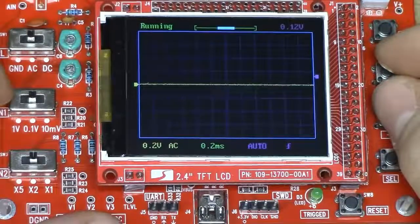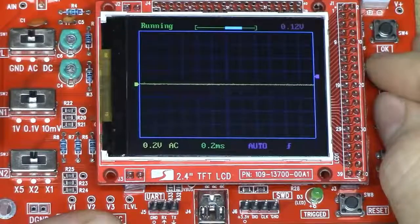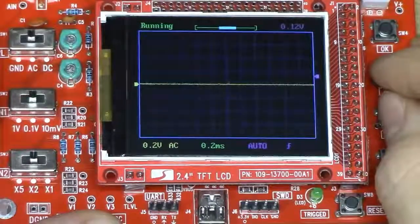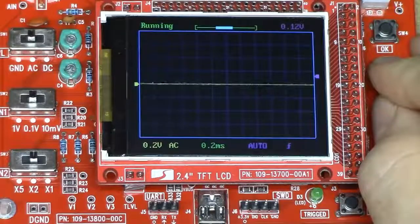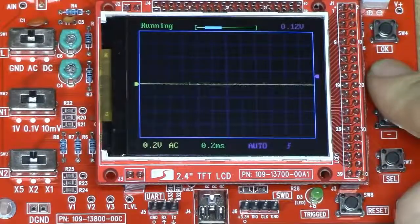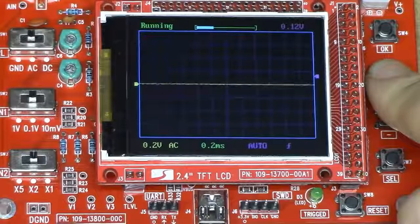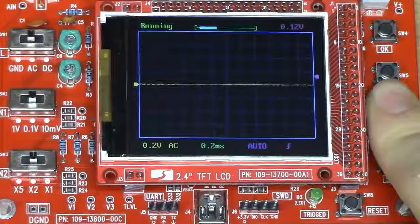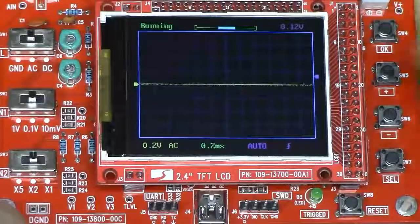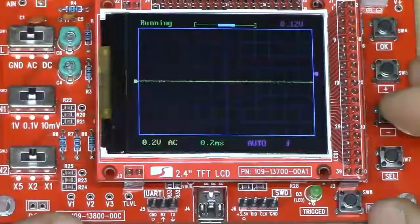There's also a scroll bar to move through the horizontal length of the captured waveform, and this is one of my biggest gripes. You cannot zoom out — you cannot get the entire length of captured data on one screen. The scrolling is also very slow: holding the button doesn't speed it up, so scrolling to the end and back takes a very long time. There's also no clear marker indicating the centre of the capture buffer.